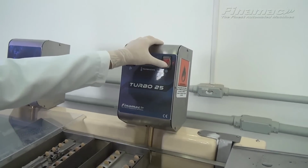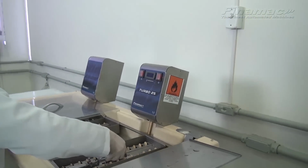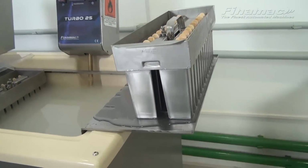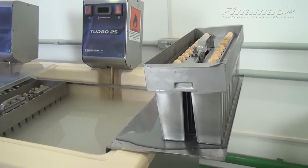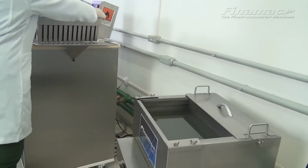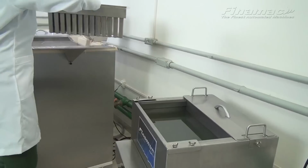Major is shutting off the machine. She has checked that the popsicles are frozen. Now she's going to remove and place onto the drip tray. And the glycol will drip back into the tank, so you can use that again. Once the tank is filled, you can keep using this propylene glycol and water mixture for as long as you like. When it starts getting a little low, you simply add more mixture to the tank. We use 60% glycol and 40% water.